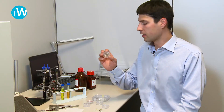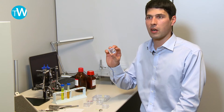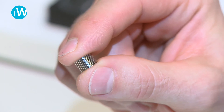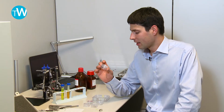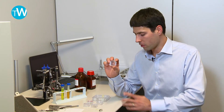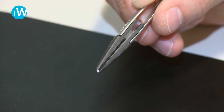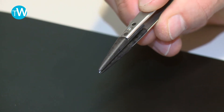The two reservoirs are made by metallic bellows. The thickness of the metallic envelope is less than a fifth of a hair. This part is not visible from the outside of the system, but it regulates all the behavior of the fluid inside the system. There is also a small ceramic part that allows for control of the flow inside the system.